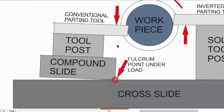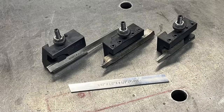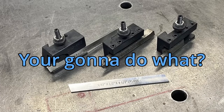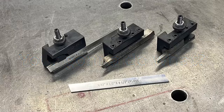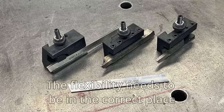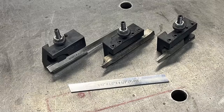Many thanks to Mark - that was a great explanation of how the setup can contribute to catastrophic failures. Now the question is: how is my tool holder going to be different to reduce these issues? The answer is I'm going to build some flexibility into the tool holder. I know what you're thinking - I just told you everything had to be rigid. Well yes, that's true, and all of the things I mentioned from BlondieHacks' video about rigidity are all true, but in regards to the parting tool holder, having some flexibility in there can drastically reduce the parting tool digging in and breaking.